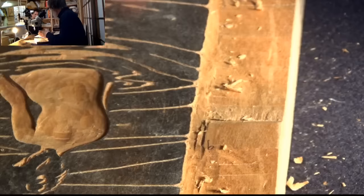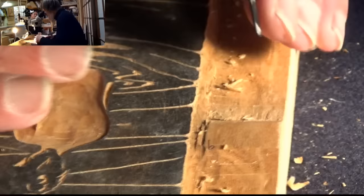He gestured me in to sit there and said, okay, now look over on the right-hand side, at the cabinet, all marked with the carving knives. He had 1.5 millimeter, 2, 3, 4.5, 6, 7, 8 millimeter carved at 60 degrees. Then again, 1.5 and 3, carved at 75 degrees. So every possible combination of whatever he thought he needed to carve at a particular moment, that would need a particular angle, they were all there.